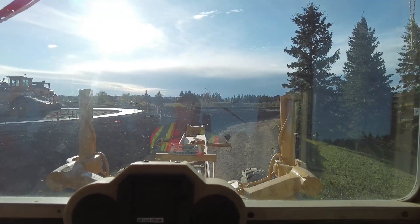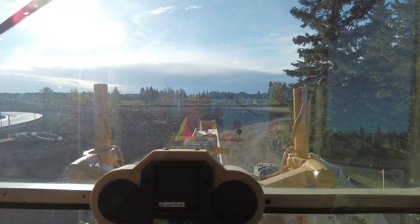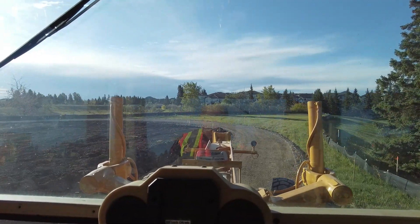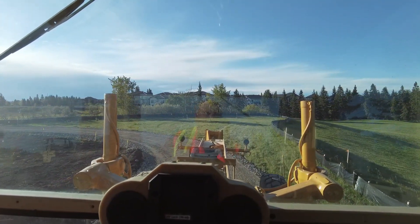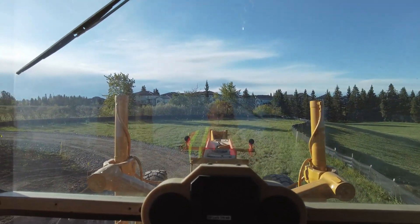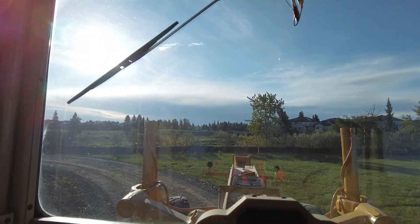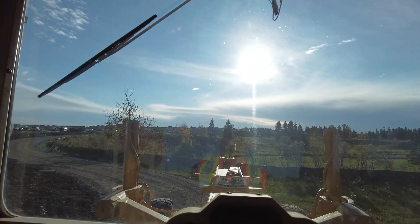Also, when you're cutting on a hard surface, forget about looking at your slope meter — it'll just mess you up more than anything. The fact that you're bearing down on the hard surface distorts your tires, pushing down on one side of your grader and up on the other. You can't rely on your slope meter when cutting on a hard surface because the measurement is too distorted. A slope meter can be very useful, but be careful how you use it.